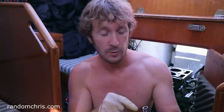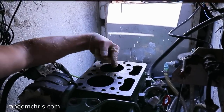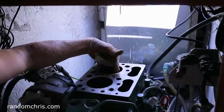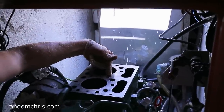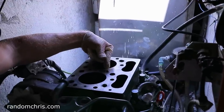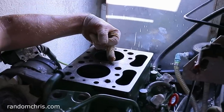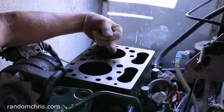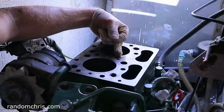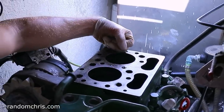Centering the hole is the most important part of the job — that's where you have to put 90% of your effort. Here we have our broken fastener, and by definition this will have been work-hardened, because as the metal was placed under stress before it broke it was work-hardened. So this is hardened material, and it's also not going to be a nice flat surface — as you can see it's got a twisting effect. So the first thing we need to do is get a file and make a nice flat area in the center.